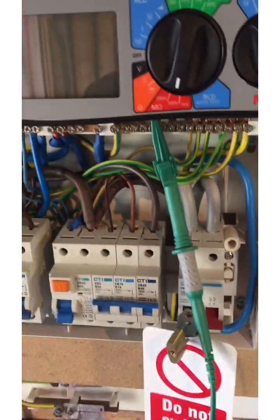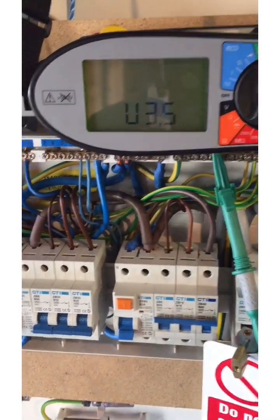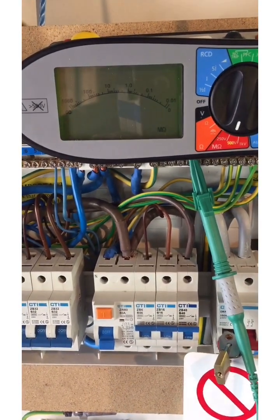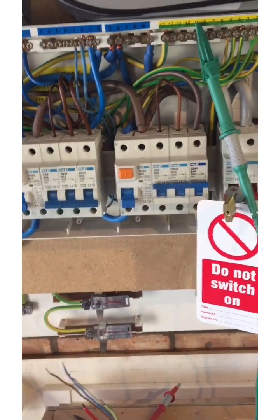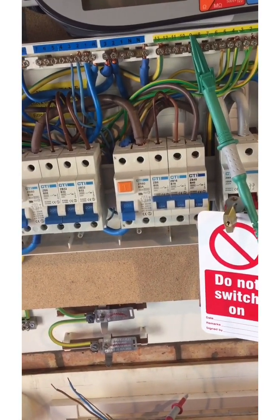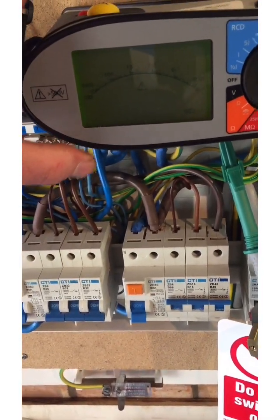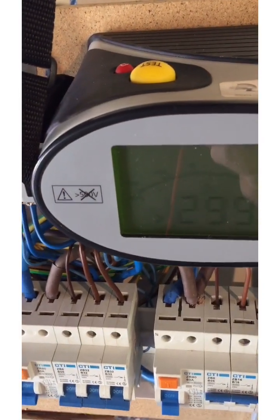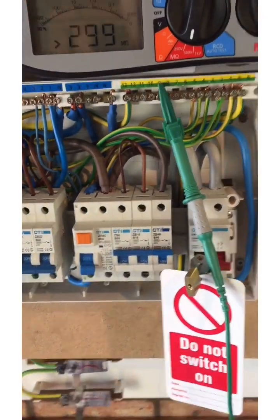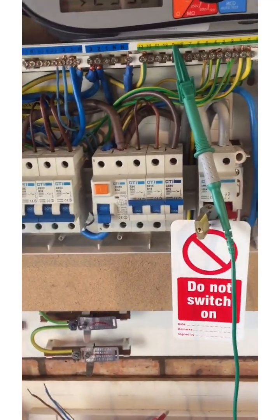If we talk about the meter, there's my multifunction meter. I'm going to put it on 500 volts. The regs tells us that for a circuit of this nature it's a 500 volt test voltage — that's Table 64 in the regs, you can check that one off for yourself. I'm going to set it up so that it's permanently outputting 500 volts. To do that on this meter, you press the yellow button and the red one together, and that will permanently give you the 500 volt test voltage at the leads. I think we're ready to go.